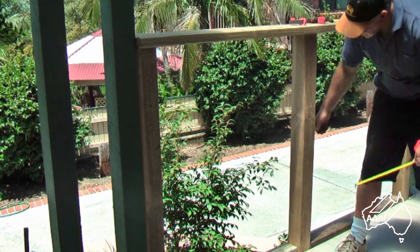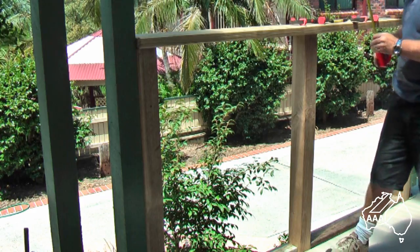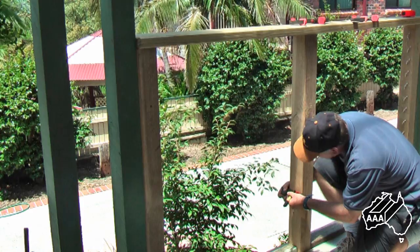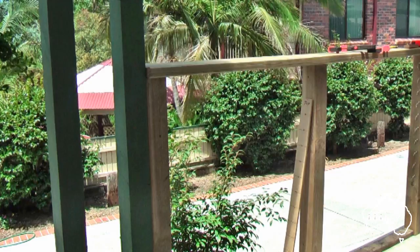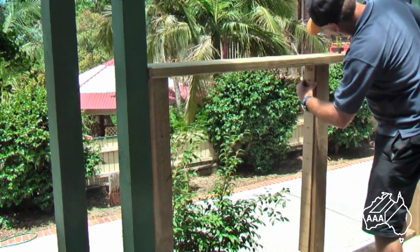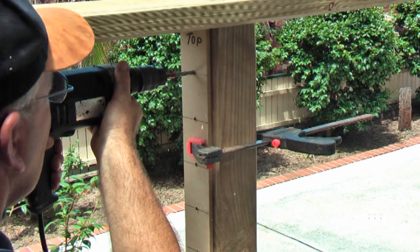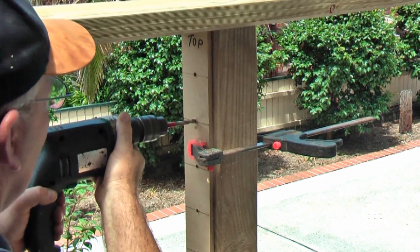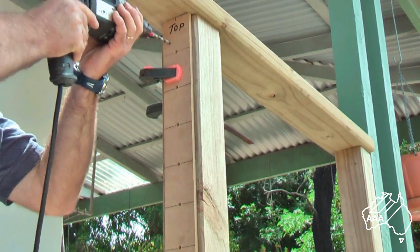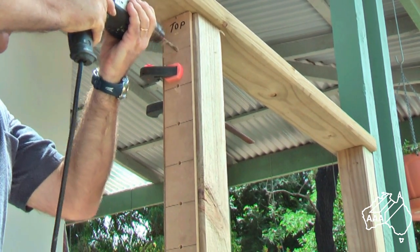You are now ready to drill out your intermediate post for the wire to pass through. Start by measuring out the centre of the post as shown and then transferring this distance onto your post, so you can correctly position your drilling template. Once you have clamped your template to the post, you are ready to drill. Remember, if you will be using grommets, you will need to drill with a 9mm diameter drill bit. After you have drilled from one side of your intermediate to just over halfway, reposition the template on the other side and drill. This way you will be certain of your wires entering and exiting the post in the correct position.